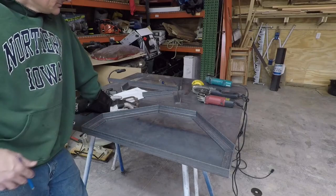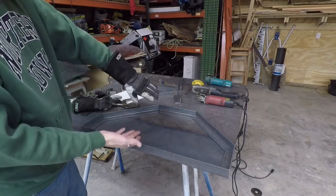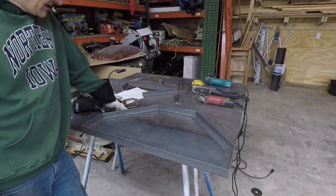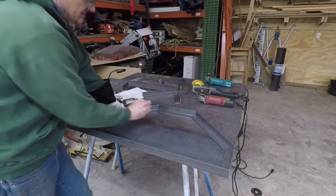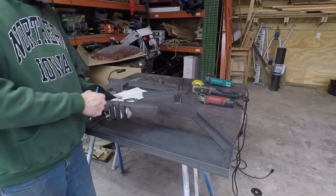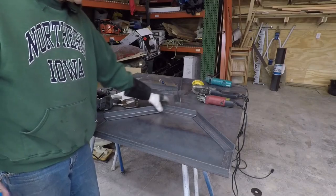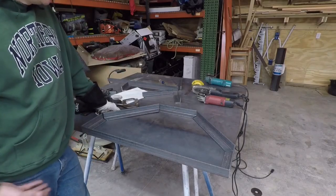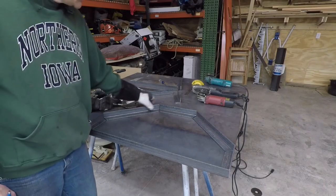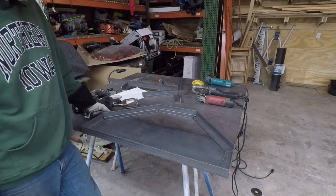So on the bottom frame, I think I'm going to do what I just said, but on the top frame, since this will actually be inverted, so you'll see the flat part, you won't see the bottom of the angle here. To have that look best, I'm going to bevel the top here, and that way I can lay a bead in there and get a nice weld, and it won't just lay on the surface and will look a lot better. Granted it's just a ballast box, but I kind of subscribe to the mentality of anything worth doing is worth doing right. And I want it to look good, because it's something I put a lot of time into. So that's actually what I'm going to do, is bevel those outsides. So I'll basically just tack it on the inside, but the primary weld will be on the outside.